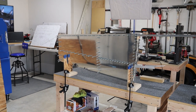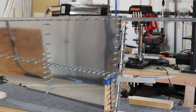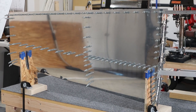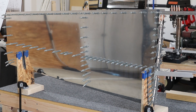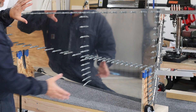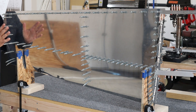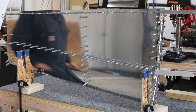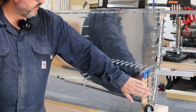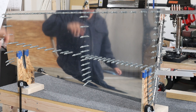Making these small but very simple cradles that I can set the horizontal stabilizer in while I'm working on it. More importantly, trying to get the skin mated to the skeleton — getting these ribs in place would have been much easier to do had I had this in the first place. So I've built a set of these.